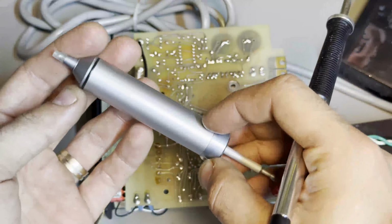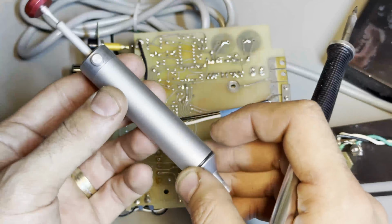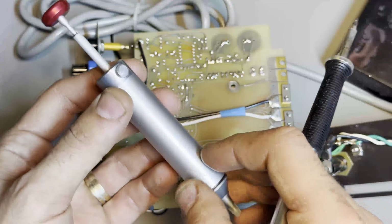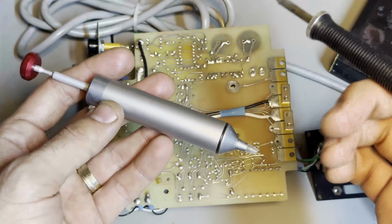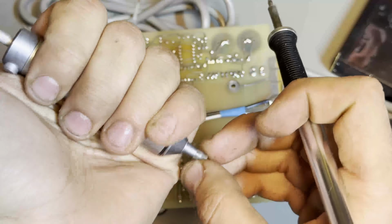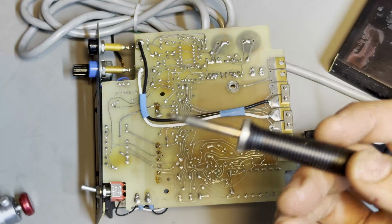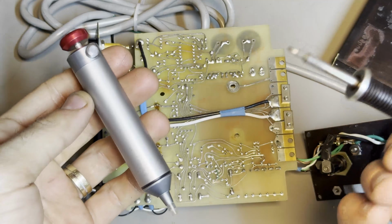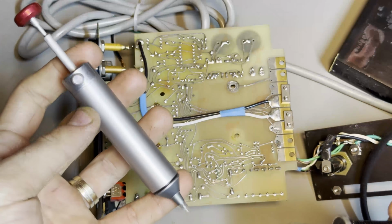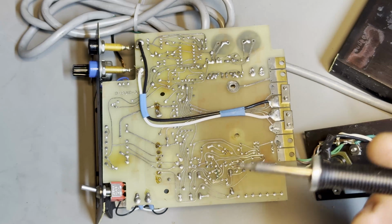You should also use a specific grease, a very, very light grease on the inside, to keep it nice and smooth. It also needs to be compatible with silicone O-rings, because that's how you keep it performing at its peak and how you don't destroy the silicone O-rings. The wrong grease on these things will destroy the O-rings inside in short order. So don't use WD-40 on this thing. Okay, I'll be right back.